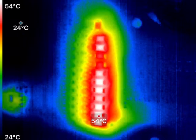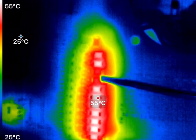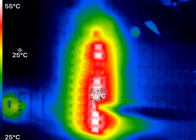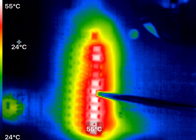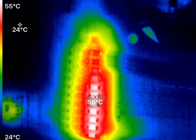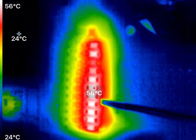You can see each one of these is a discharge resistor here. When the resistor turns on to lower the cell voltage and balance the cell, you can see that it heats up. Then the cells will turn off. These two cells are off, this one's kind of coming on and off, and these are on pretty solid right now because they're at a higher voltage.